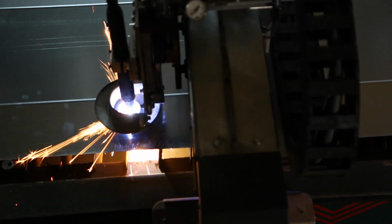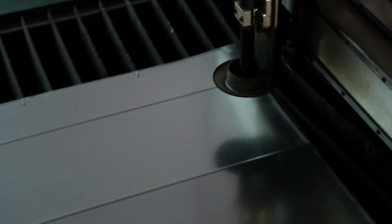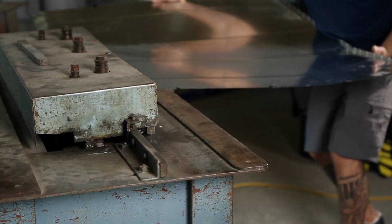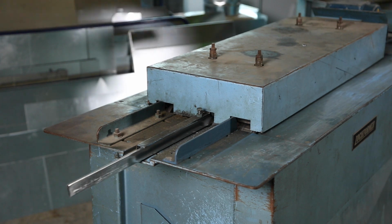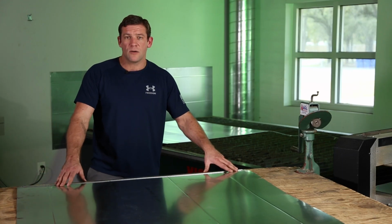We showed you how to insulate round pipe, and now I'm going to show you rectangular duct. This is actually a little bit easier than round pipe, but it still is critical. It's tedious, and there's some things that you need to know about to be able to do it right. There is a male and a female on rectangular duct as well, and there's a lip we actually leave on for the S-lock side. So the first thing we start with is cutting our pattern.